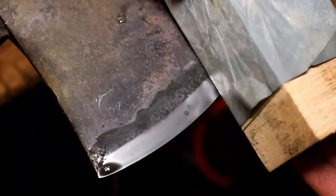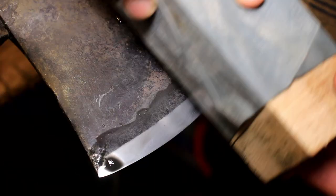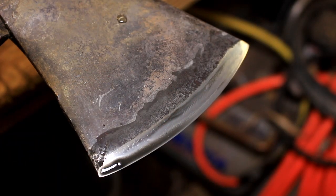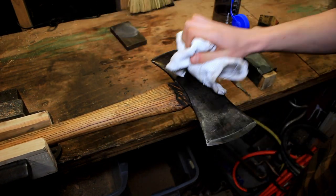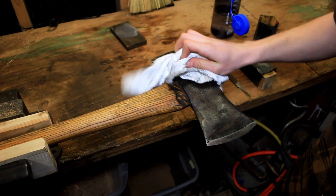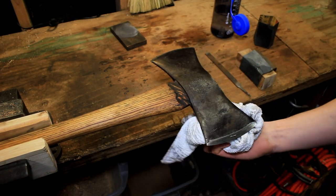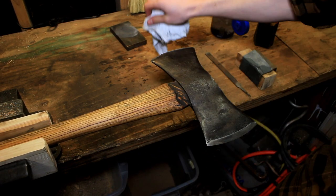At this point you have to be a little extra careful - the other grits you have to be careful, but nothing like this. This will take your finger right off. Alright, about 25 minutes in and it's time to switch to the other side. We're done sharpening - we'll strop it in just a second. Before anything, we need to dry everything so it doesn't rust on us, because we just put time into this blade. Either way, you put your personal time into it, so just make sure it's as dry as you can get it.